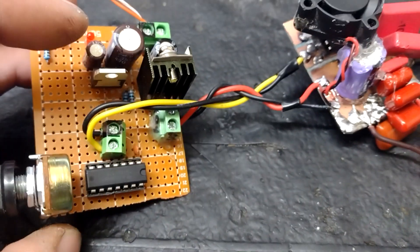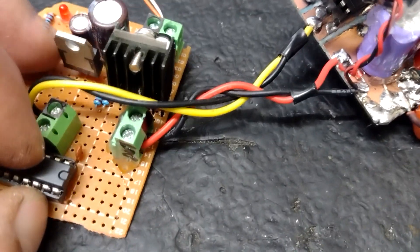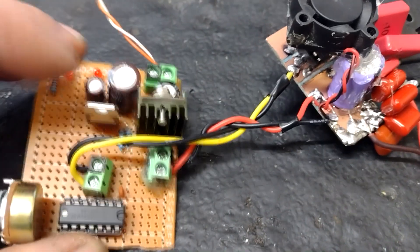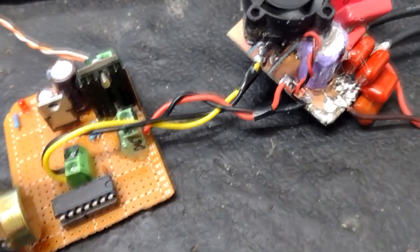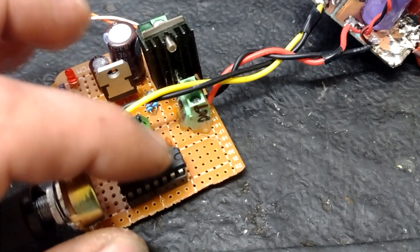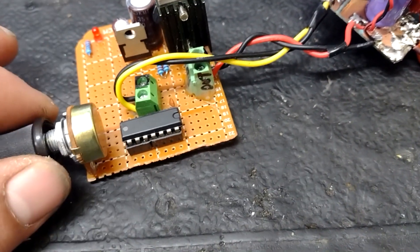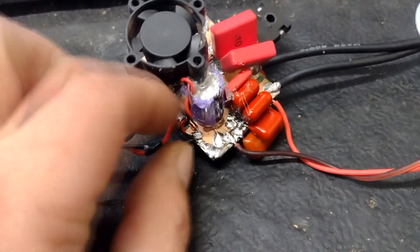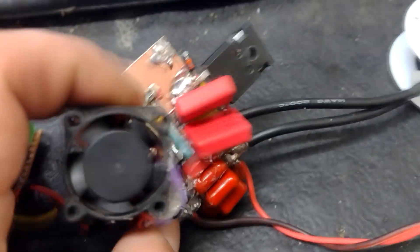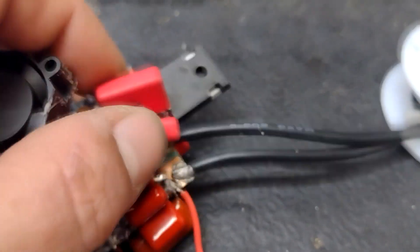It's using the 74HC14. I've got a 5k pot, and I think the capacitor value is something like 150 picofarads. I started off with an 18-volt gate drive, and with this setup I was getting a pretty clean square wave up to about 10 megahertz. After that it started to slope around, but up to 10 MHz it was pretty decent. At that 18-volt drive — which is about the max I could feed this chip — it was just too much for it once I started getting over about 2 megahertz. I've got fairly low gate resistance here and no external capacitance at the moment.